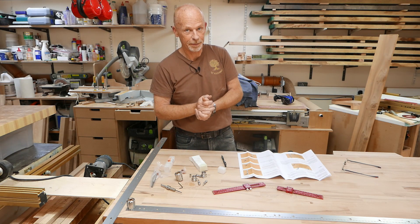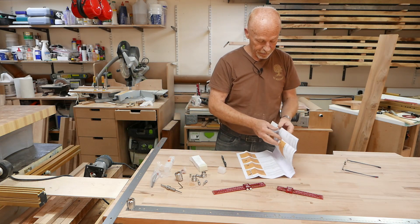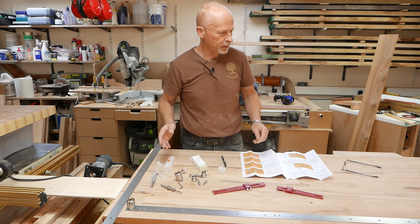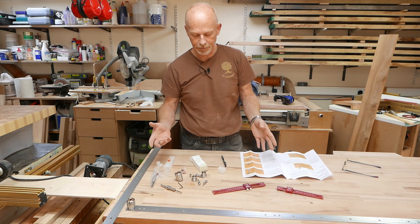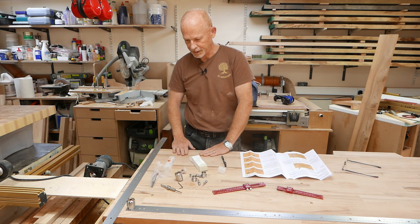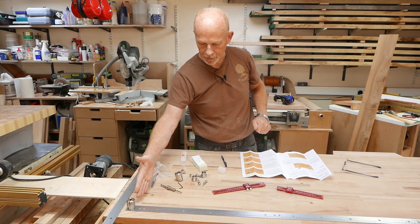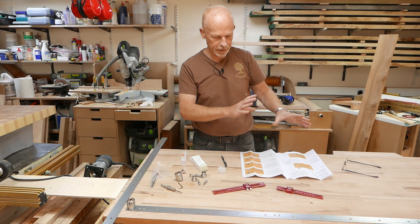It's not as if it's a tabletop — it is a bench. So I've read the manual — I know, shock horror — and it's really quite easy to follow with lots of lovely pictures. Now the layout: I need to be quite careful as I've got a support rail there, there, and there underneath, and my bench top is screwed down. So I need to make sure my dog holes are either side of these rails. I think I'll avoid the end two — the middle is easier for me to deal with.